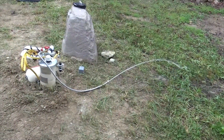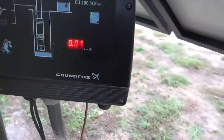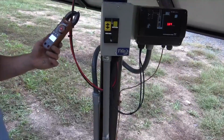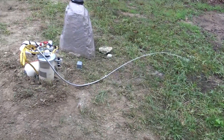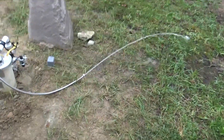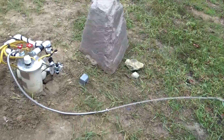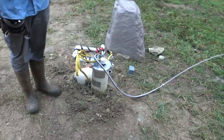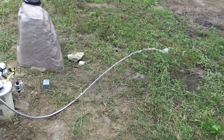It's not very impressive, but it is raining — and there's water out of your well without batteries using the Grundfos. We only have 90 watts, but you see the LED — it shows it's pumping. Green LED: we're running at 90 watts. About a half an amp times 130-140 volts — that's like 70 watts; the clamp meter says about 70, the CU-200 says about 90. We've made it to 100 watts — she's pumping! This sure beats a hand pump. The Grundfos pump is about the same cost as a simple pump. Even in a grid-down situation, it is lifting from 40 feet; the pump's capable of lifting hundreds of feet depending on your total dynamic head.